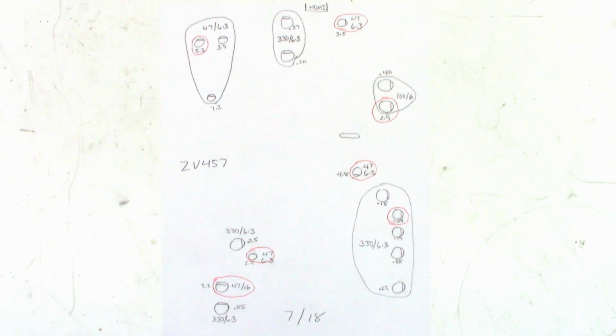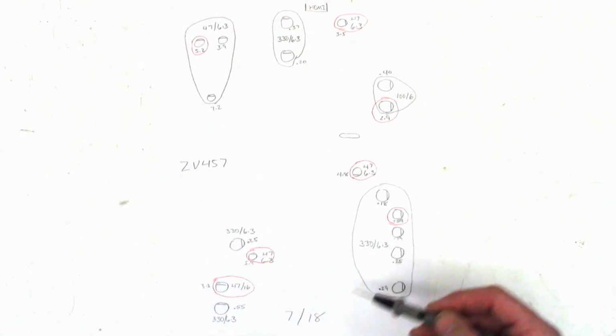And so once I have them all off the board and the leads are broken off, we'll go ahead and ESR them. I'm going to try to put numbers on each one so that we can compare the new to the old off of the board, because I can't really unsolder one lead of these capacitors effectively off of the board like I do with a standard power supply, where you've seen me unsolder one lead. So I have a suspicion that a lot of these are probably in parallel with other capacitors, so they may actually test way worse out of circuit than they do in circuit. So I'll go ahead and try to number all these, get them off the board, we'll do an ESR check and see if the results are close to what we have here.